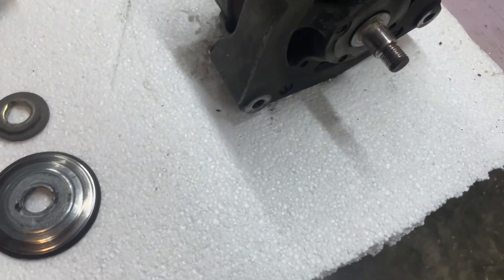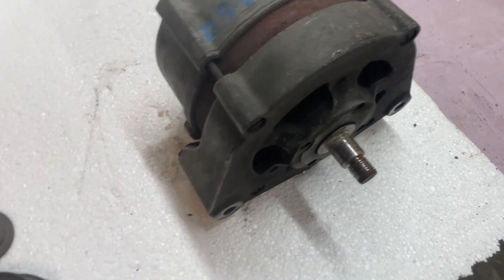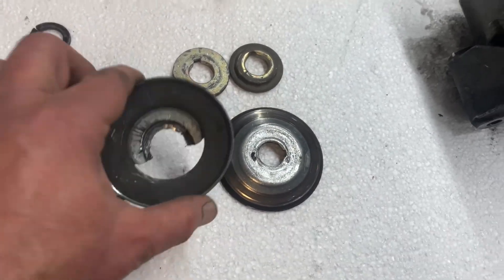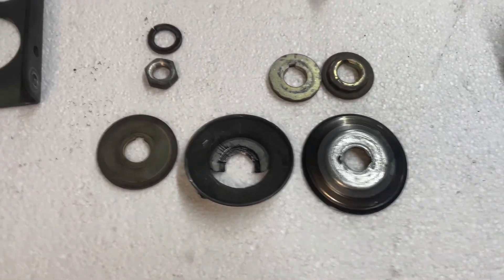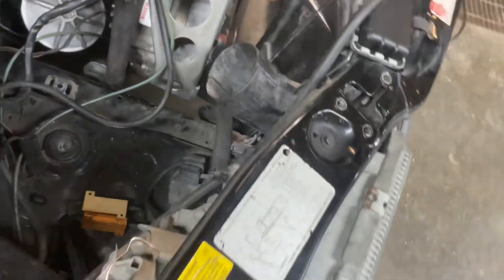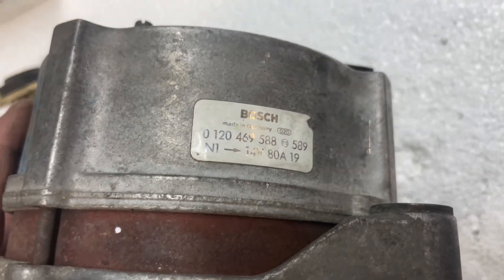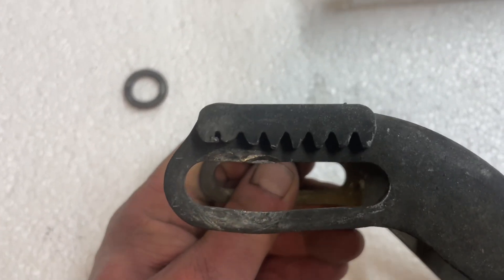The reason for that was because the eBay unit had this pulley system with these parts, and you can see what happened — I put it on yesterday, drove 10 miles, and this is what my belt looks like. It got all chewed up and twisted because this broke. The AL69X alternators use a different pulley system than the standard Bosch. The part number is 120 — I think 124 — 69588589, 14 volts, 80 amps.